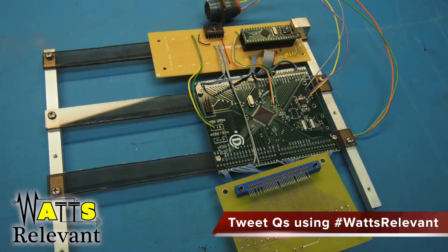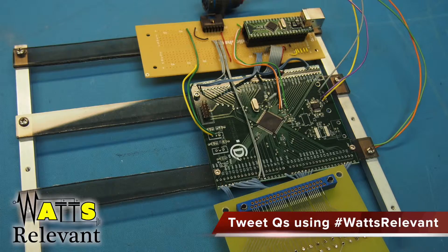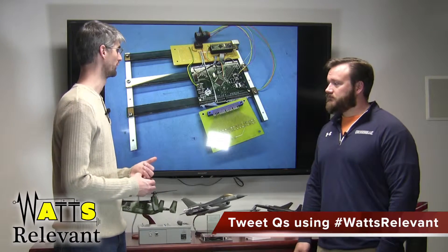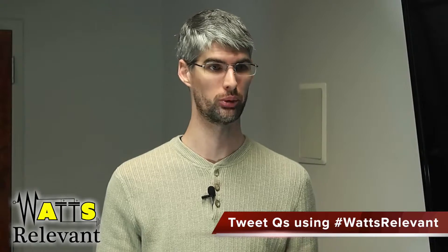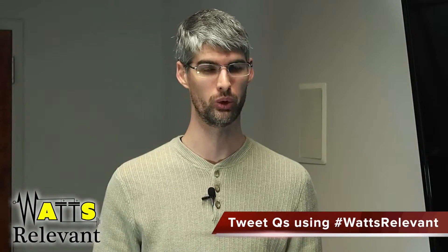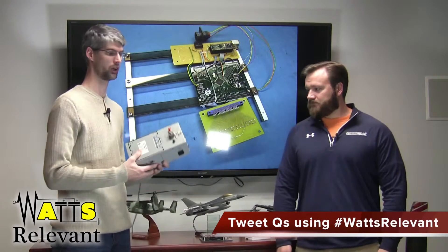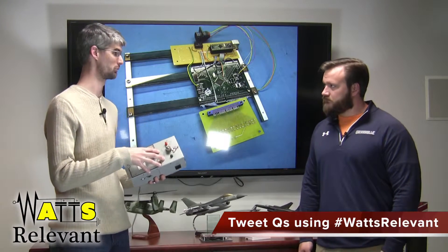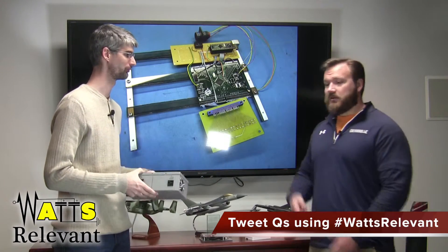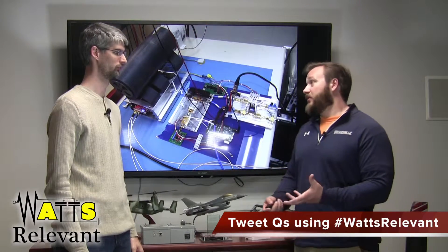When it comes to transitioning from a prototype to an end-use product, this is an example of something we put together that became an end-use product. The board you see in there has probably been seen in a couple of these pictures, because it was a circuit board that solved some general problems that we used in multiple different things. We paired it with some hand-assembled boards and a quick prototype PCB with some hand wiring, and threw it onto a frame to build a test. This was a fully functional version of what became our end data transfer interface unit product — it has the exact same circuitry but on a new board. This prototype allowed us to build and do software testing before we ever had a packaged product. That design reuse lets us do things less expensively, not expending non-recurring engineering cost every single time.